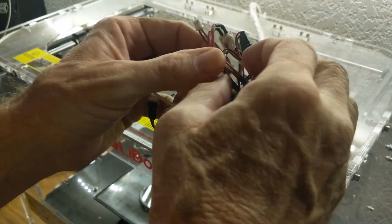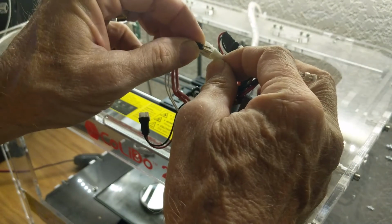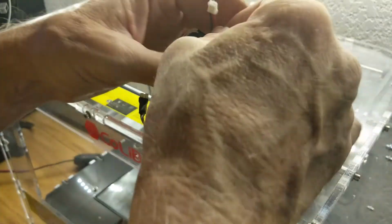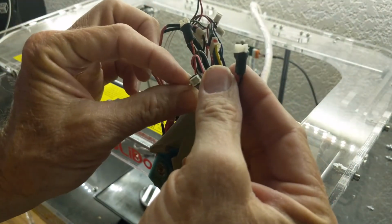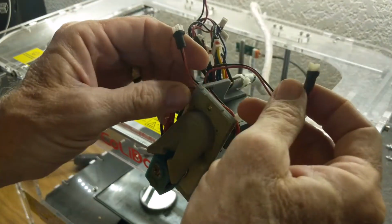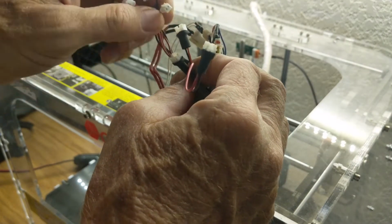Okay, then we're going to hook up the thermistor the same way. Let's find that connector, it's right here. Again, polarity doesn't matter, so we'll just shove these pins in like that. Okay, now the remaining things on the print head are on these connectors right here. It's the fan for the part cooling, it's the fan for the heat break, and it is the LEDs.